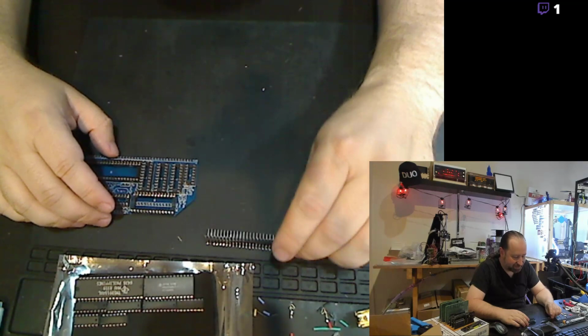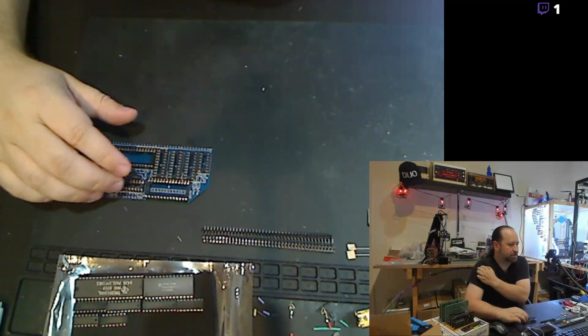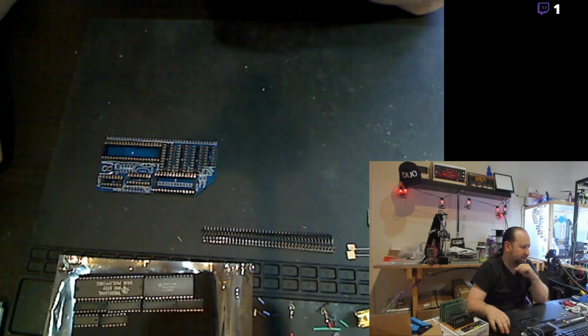The one I have, since it's just a DVD laser, I think it's limited to like under 10 milliwatts or something. It's really, really low. But you overdrive it, it acts as a burner pretty well. And of course, I could make it larger and actually put together a 3D printer style, like a Cartesian style printer with the laser attachment. They've got 100, 200 milliwatt lasers for pretty cheap on like AliExpress, that kind of thing. But I don't really have a need for a big laser engraver.